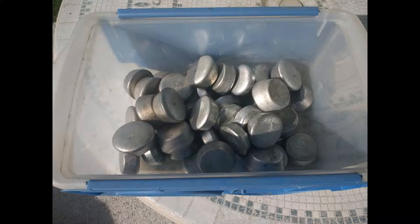The ingots you see here aren't just from the hard drives from earlier in this video but a number of other hard drives I've had stacked up around the house for the last year or two. Originally when I was melting this down I tried to remove all of the magnets, all of the controller boards, anything that wasn't direct aluminum — the motors specifically, things like that.